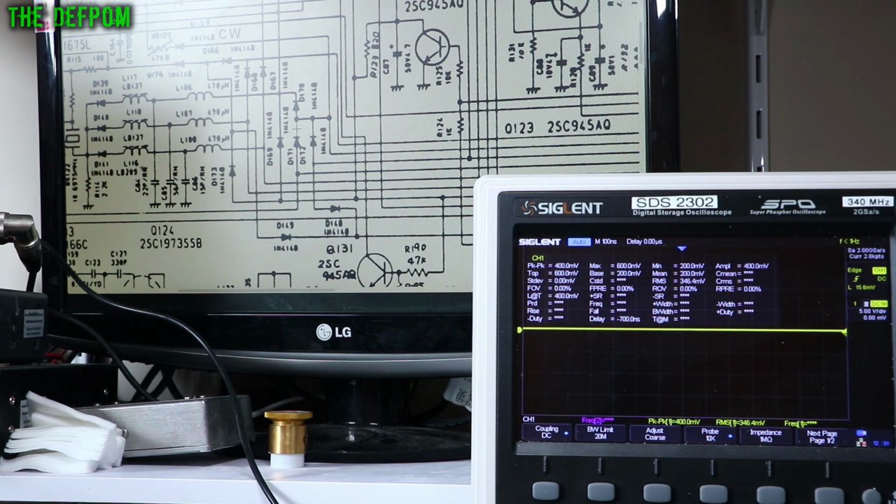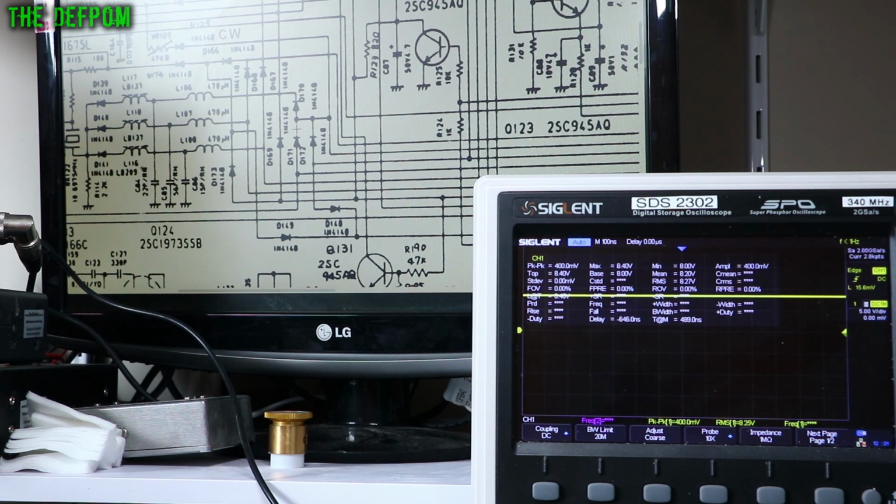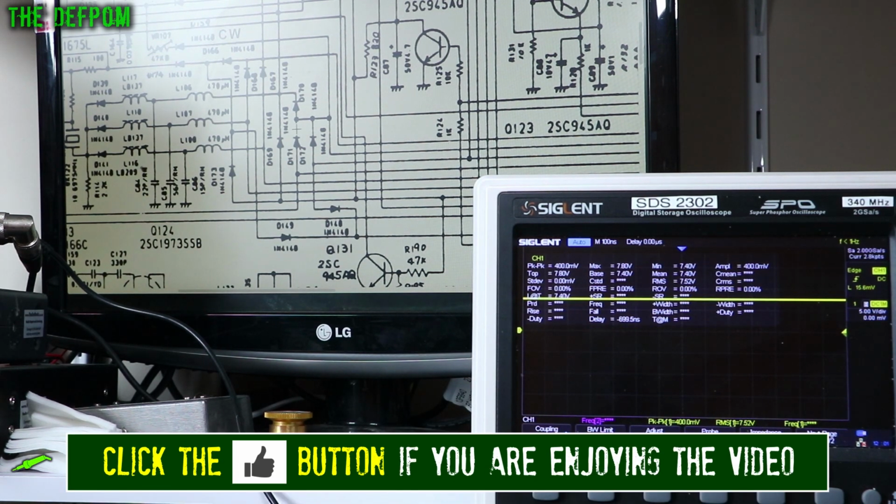That's on AM receive, AM transmit, nothing there. If I go to the other side of the diode, we have a voltage. AM transmit and receive. Go to FM, it disappears. Sidebands disappear, CW disappears. Right, so it's only AM is this one here passing through, but it's not passing through. It's not there. If I go to FM, then it shows up. So that diode is probably dead.